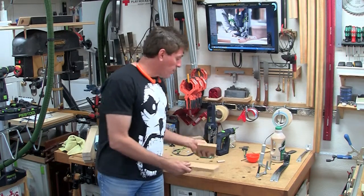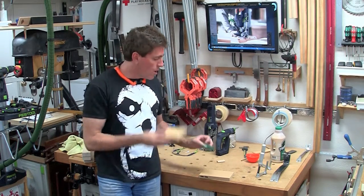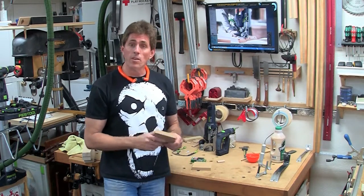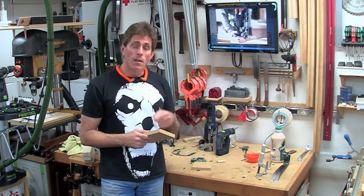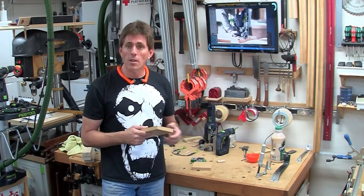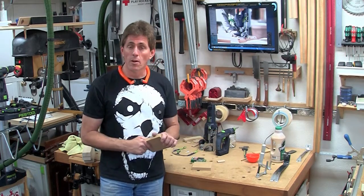The way we're going to do this test: I have two pieces of MDF. I'm going to put a three-quarter-inch back screw most of the way into this piece of MDF and leave a little bit out. In this one we're going to reinforce it — we plow a hole for a domino, put a domino in there with glue, and then put the screw in. At assembly time when the glue is still wet you could probably pull it out pretty easily, but we're going to let the glue set and then try prying it with a pry bar to see the difference.